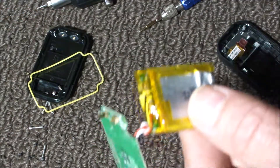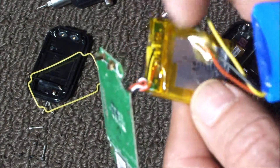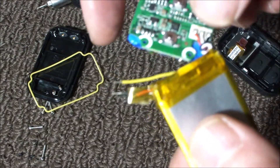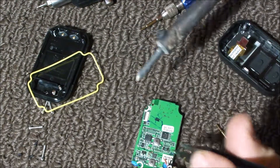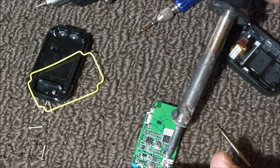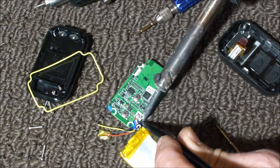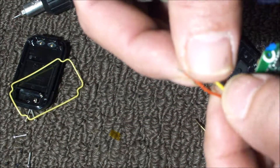This battery is a little bit mangled, but what I'm going to do is stick this back on the board in the same direction where the wires on the batteries are, so that we'll have this positioned once we remove the solder points here. Once we remove those wires with the soldering iron, I'll then go ahead and put the new ones on. I'm going to cut these wires just a bit — I don't want a lot of overhang.